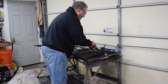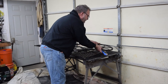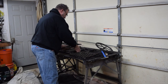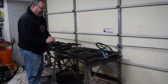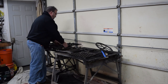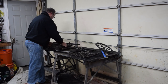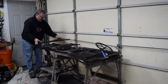So what we're gonna do now is flip this over and get a light coat on the back. And then our pieces will be protected from rusting. And then we can get back in here and get the final coats on them when the weather is a little bit more amenable. Since we are under both a flood watch and a high wind warning right now, I don't think we're going to be shooting any paint outside.